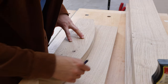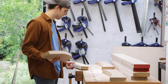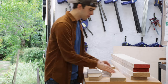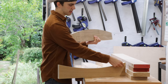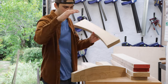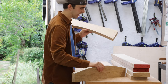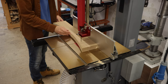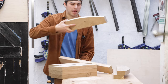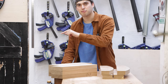I'm going to cut that on the band saw and sand it again. I've cut both arcs and they'll be positioned at the top of the gate, hinged so you can adjust the opening. With this off-cut, that's going to be the bottom rail, so I'm trimming this section off on the band saw. I'm keeping this off-cut because it'll give me a flat reference surface for clamping later without bruising the arc. The top and bottom of the gates are now cut and I've also cross cut the banisters. I'll rip these boards into banisters on the band saw and then feed them through the thicknesser to remove the bandsaw marks.